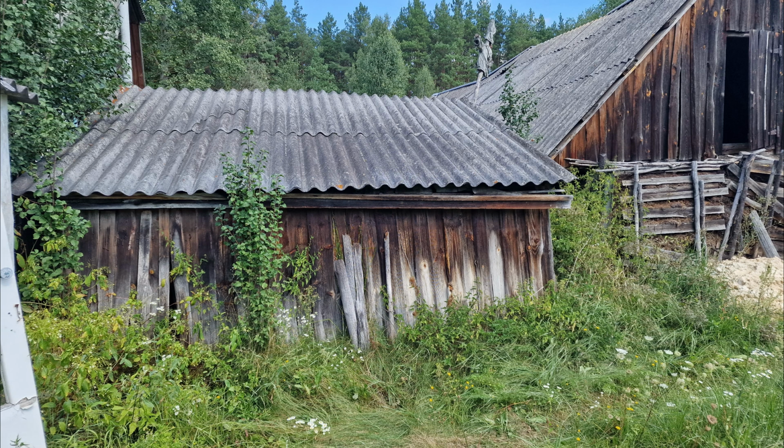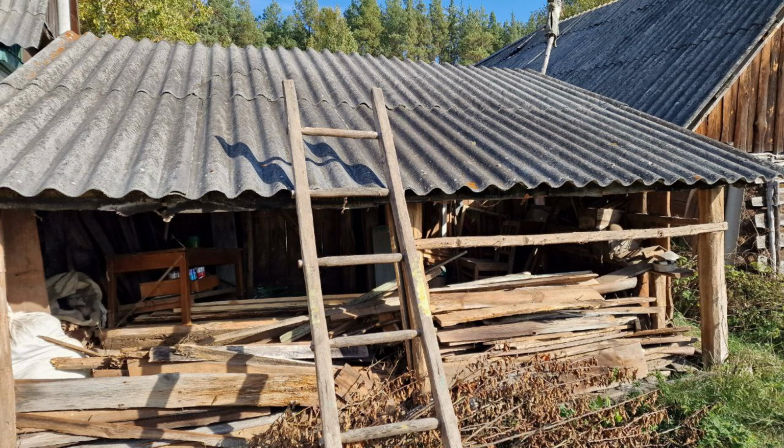I thought that an easy way to repair this or to transform it into what I needed was to remove the exterior walls, lift the roof because the height on this side was no longer okay. It was less than 1.3 meters. Reinforce the walls and change a bit the material because it was old wood. Insulate maybe inside, and change the door. Well, I was about to discover that my easy solution wasn't so easy.